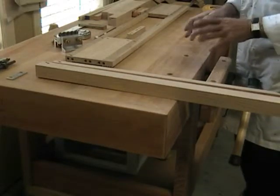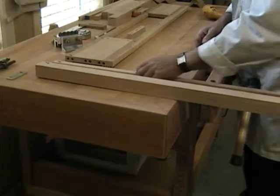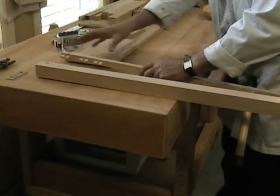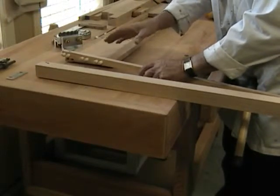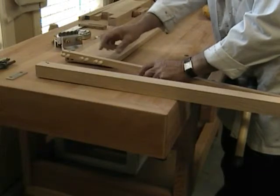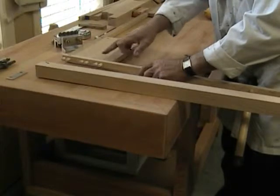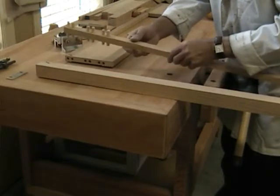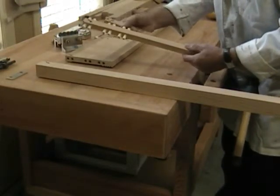Now this is a new concept — this is only the second time I've done this. Sometimes when you're joining three pieces together, the dowels can be configured and can foul each other. So what I've done in this case is I'm using one dowel — well it's actually six — but one dowel to connect three workpieces. To do that, I drilled right through the inner vertical using a backing piece to avoid tearout.